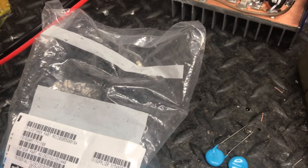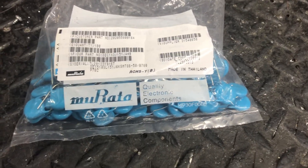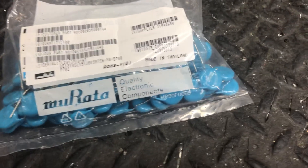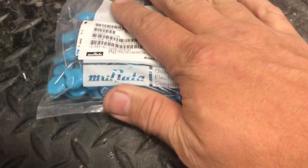These caps are great for tuning four-pill sections. I was using the silver mica DM19 sold by a certain company on my eight-pill and four-pill sections for tuning. What was happening is that 140 puff, five-dollar cap would blow, and when it blows it would cause the amp to blow pills. You'd have a mismatched combiner failure, pill failure — it was a mess. This happened more than once with the five-dollar cap.